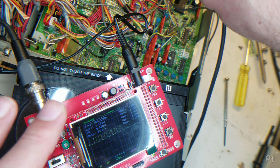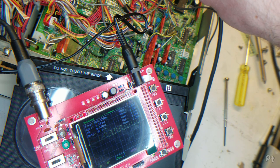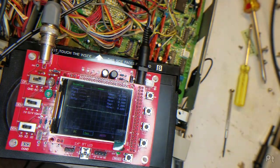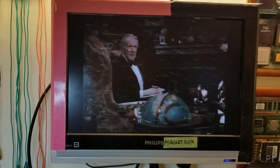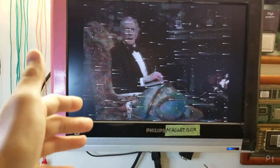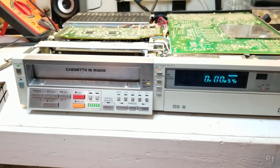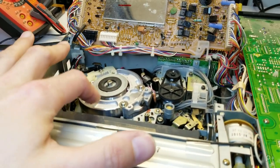I love these tapes with the windows — they're the most gorgeous Betamax tapes, they look like a Betacam tape. So I had it perfectly adjusted for the correct duty cycle on one tape, but then it was off again on another Beta 3 tape. That was just a little show and tell of this model — not a lot of info out there. I like it because it's a slimline model. I forgot to mention it has the DA+1 head configuration, meaning it has the extra head for special effects: one head is dual azimuth with two heads in one, and one is a normal head, similar to three-head on a VHS.